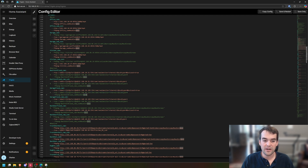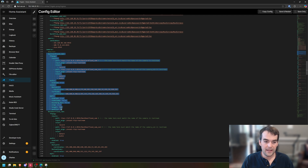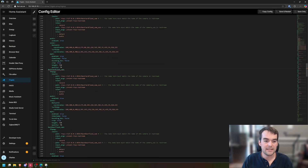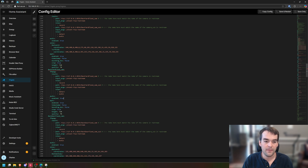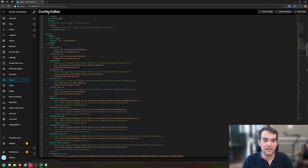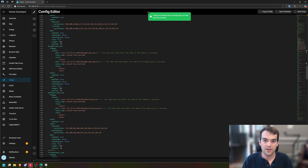I was trying to figure out how to use Opus audio to make it load faster on my phone and kind of gave up, but I didn't want to lose my progress. Now that I have the garage flood cam and garage flood cam sub in go2rtc, we scroll down to the actual cameras section and again copy the backyard flood cam entry entirely. Press Enter, paste it, make sure everything lines up, delete the zones because those are based on a different camera, then update the name to garage flood cam. This references the go2rtc config which processes the camera feed from the camera through FFmpeg and into Frigate. With this I should be set to save and restart, and it should come right back up.